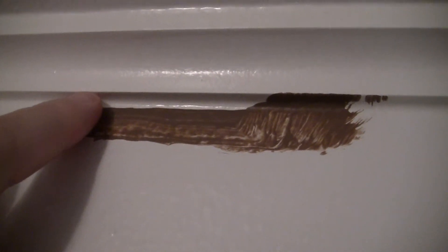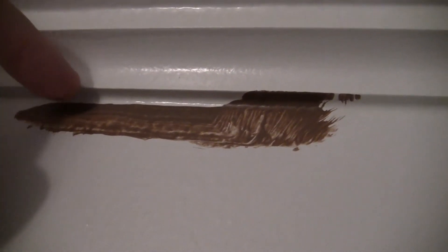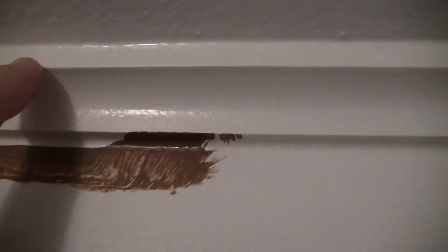As a painter you can get as close as you want to the top here, because no one is going to be eight feet tall and look right there — they're always going to be looking up this way. But you can never, ever get the paint on the horizontal ceiling surface like it is right here. You see how it comes over the molding? You can screw up your line a little bit on the wall, but you can never get the brown paint onto the ceiling.